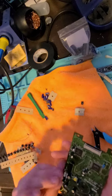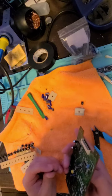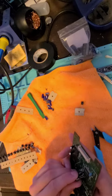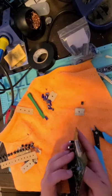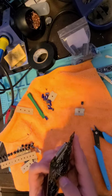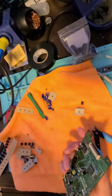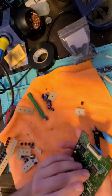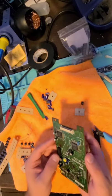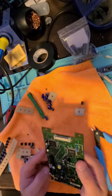Here, I'll explain why. So, yeah, we missed C7. Well, this is the one we just yanked out. C7 is 100 microfarad, 6.3 volts. This is 10 volts. This is rated for 6.3, but you can use a higher voltage one. However, all of the 100 microfarad 16 volt ones I have, this giant strip of them, all the internals use is that. By internals, I mean the main motherboard, and I will be recapping that board. So I was a little worried at first, but I caught it.